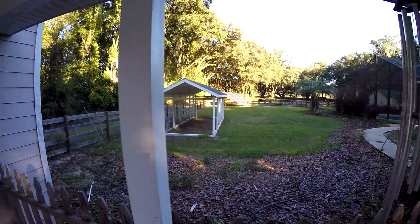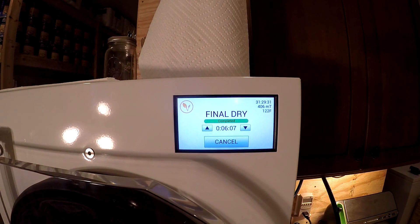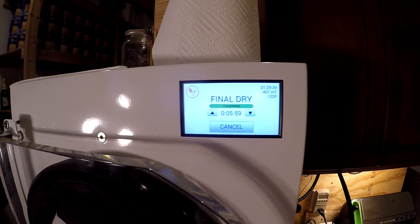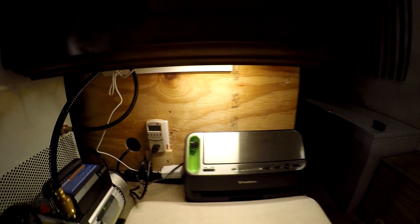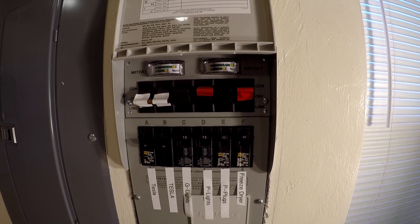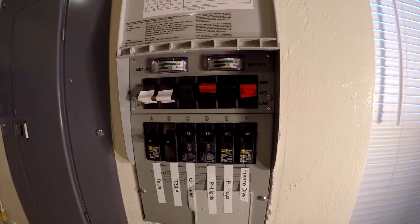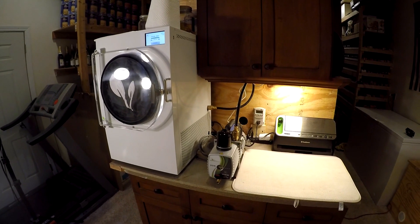It's about 4 p.m. and I'm starting to lose my sun on that ground mount panel, so we're going to go ahead and shut this down. It ran for about 32 hours — I did add 9 extra hours to make sure it was thoroughly dry, and since it was in the sun running for free, why not? It ended up at 22.65 kilowatt hours for the whole process. Solar power held out great and worked just fine. In particular, the transfer switch is what allowed me to switch to the utility for a little while during the night so I wouldn't drain my batteries too much. We ended up with about 5 kilowatt hours on the utility and the rest was all on solar or the batteries. I think this definitely works out great — this is what we'll be doing. Thanks for watching, I'll see you on the next one.